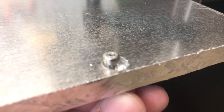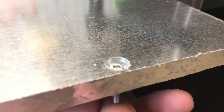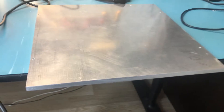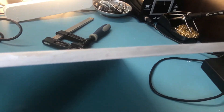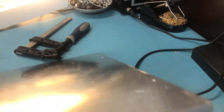I've now drilled those two holes. As you can see it's a two-stage thing — it allows you to have the head of the screw below the surface without passing through. I used slightly larger drill bits than the recommended ones because I didn't have those, but it's good enough and should do the trick. I also sanded down all four sides, which took much more effort and time than I anticipated, but it is done.